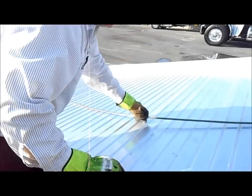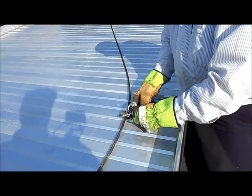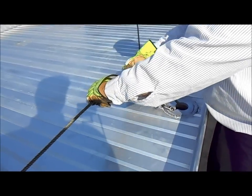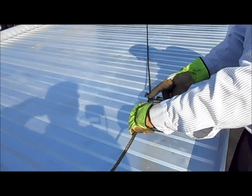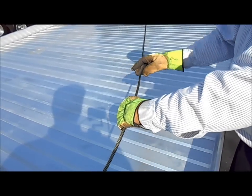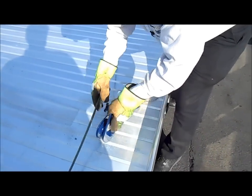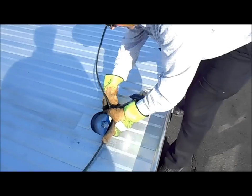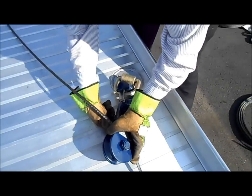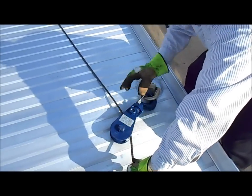You don't want to use a chain to pull your cable, because if you're pulling something up with just a chain, the steel is going to end up cutting your cable. That will ruin and destroy it — it will start fraying out in little pieces and mess up the cable. If you've got a pull from the side, you want to have your snatch block. Put it in here, and then you've got a roller that will pull the cable this way without messing up your cable.